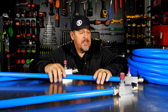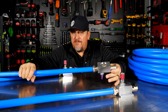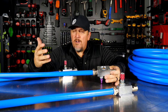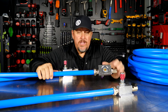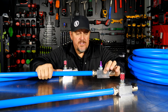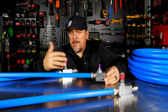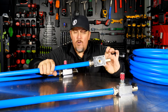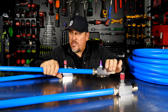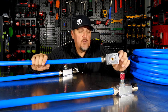We had no leaks in it, not anywhere at the couplers, not anywhere where we actually screwed in the fittings. So I highly recommend run a few wraps of Teflon tape around it. We use Blue Monster, but you can use any Teflon tape. And then we back that up. We use some of it with some regular pipe thread sealant and others with the Teflon sealant. Both of them seem to work absolutely well. And that's going to ensure that you don't have any leaks and that compressor is not going to continue to run when you leave for the night.